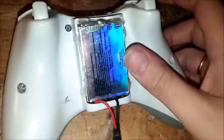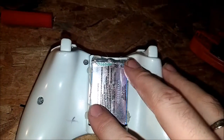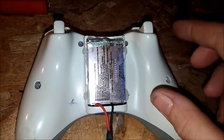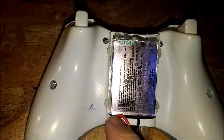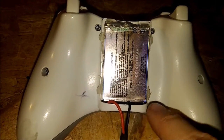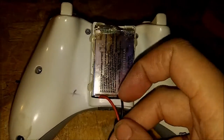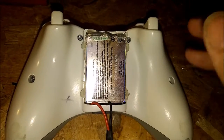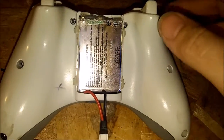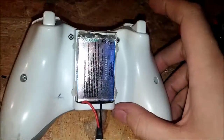To connect your wires, have your controller facing toward you with the triggers out. The positive is on the left side, the negative is on the right. What I did was directly solder these wires to the little spring pins in there, and that worked out just perfect.